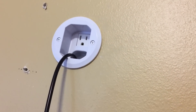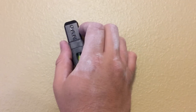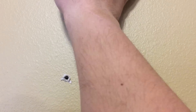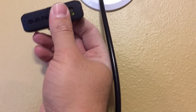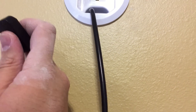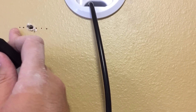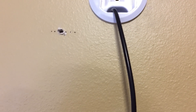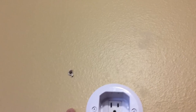The magnetic level attaches to a drywall screw — probably right there. You can see I'm still dusty from putting in the in-wall power cord. It shows basically where that drywall screw is and where another one is, giving you an idea of where the stud is. It also comes with a little nail on the end, and they tell you to poke left and right from the drywall screw to find where the stud ends. I kept poking until I found the other end.